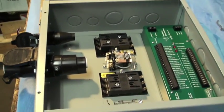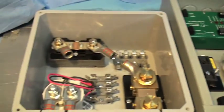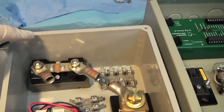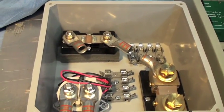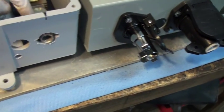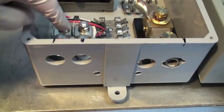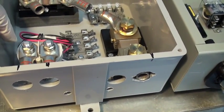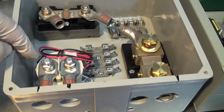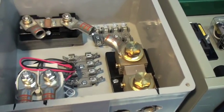This is after I've got everything bolted in and before I take it to paint - this is what it looks like. I had to rearrange this just a little bit. I moved this shunt over here so I'd have enough room to actually have a connection. This line is going to come out this way and come through this hole right here. The most negative line comes in here and goes through this shunt and back to the most negative aspect of the battery. The most positive aspect of the battery will come in here and go through the contactor. I'm going to run my charger lines into this also so I can count amp hours going back into the battery - as it goes through the shunt, it'll record amp hours going back into the battery.